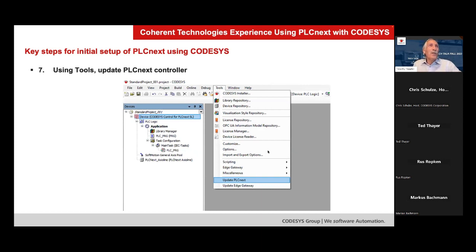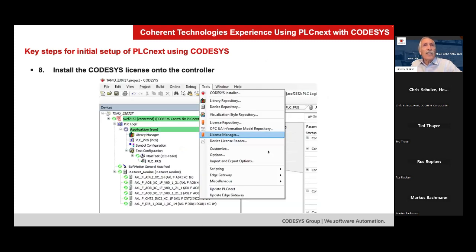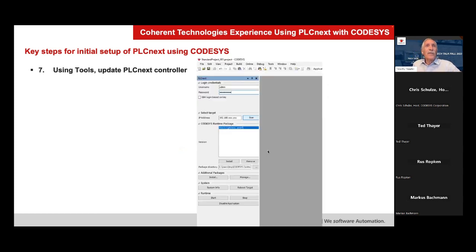But you're not finished yet — there's a little more that needs to be done. Select the device and go under Tools to update the PLCnext. This will open up communications to the PLCnext where you can log in with your username and password. From here, you will install the runtime package for CoDeSys, and start that runtime. That is what switches the PLCnext hardware from running the engineer package from Phoenix Contact to running the CoDeSys system instead.